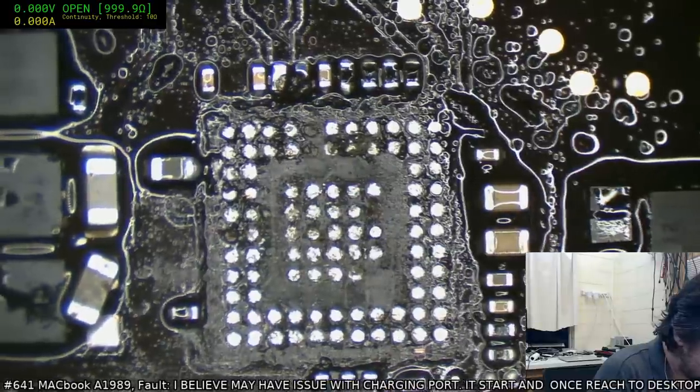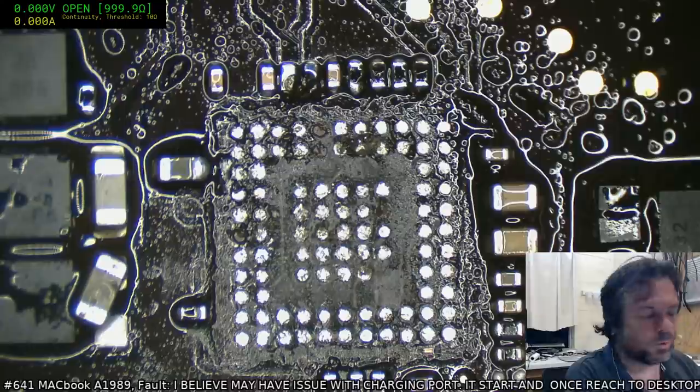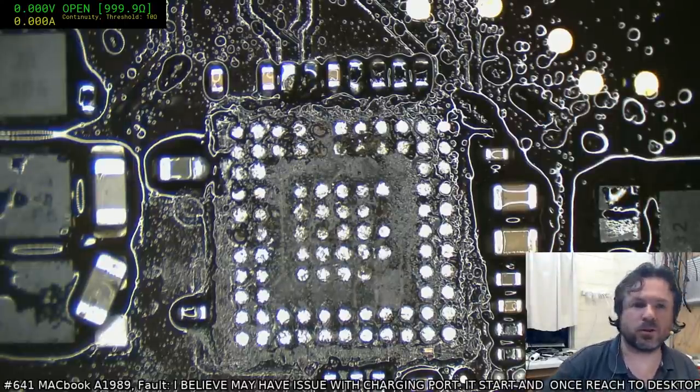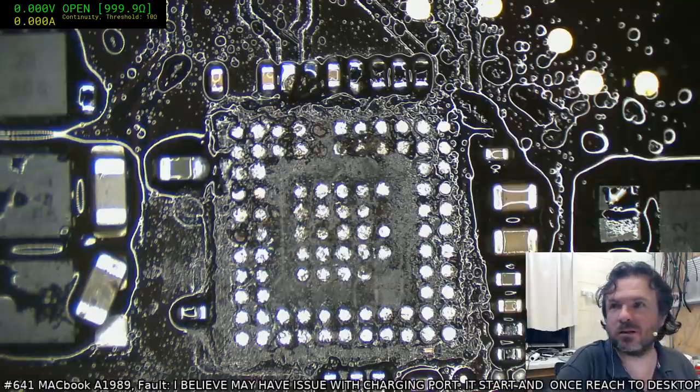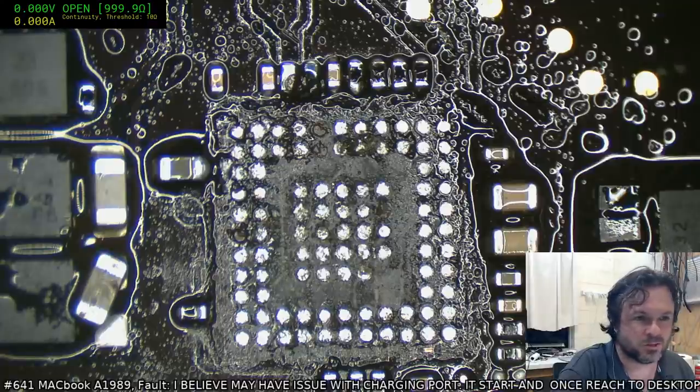Thick, because it'd be just a standard footprint, and therefore it's just easier that way. Make sure all pins are accounted for, because you don't know whether someone's going to, by habit, tie all the NCs down onto something. But that does remind me, we need to check the pads that we do have missing to ensure that things are still connected.